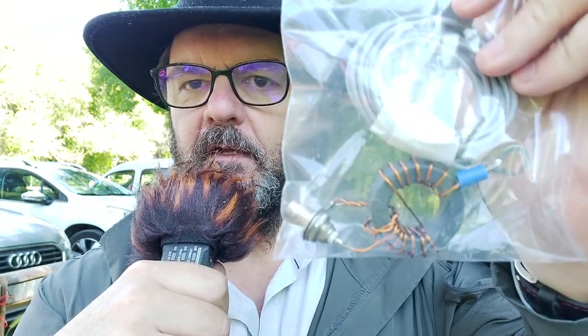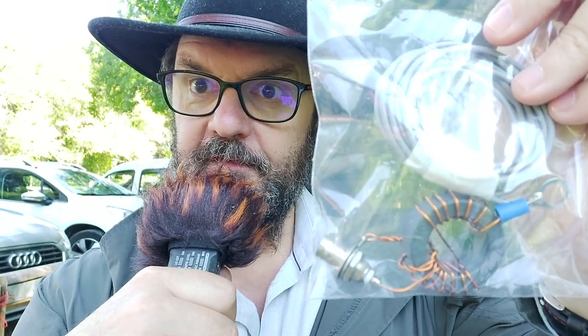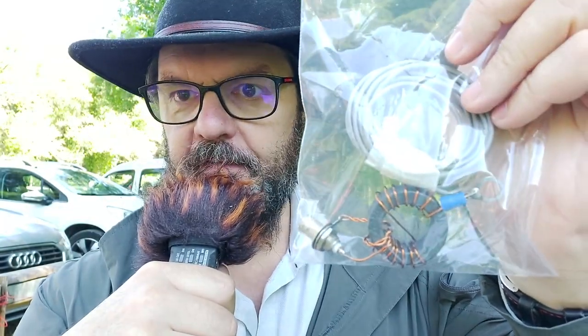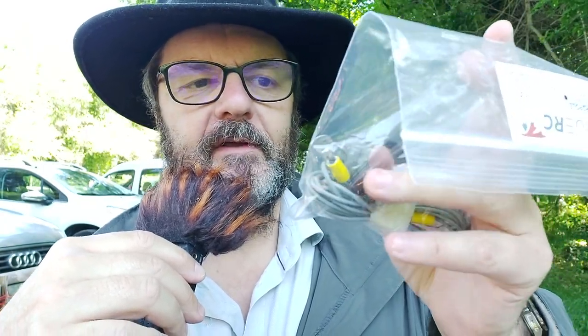So I have a 49:1 with, I think it's an FT140-61, so 61 material, presumably better for VHF than 43. And I have the classic, oh no, that's the other one. What am I saying? That's the 49:1 with the 61 material, and that's a 16:1 with two turns primary on 43 material. So the question is, which one works best?